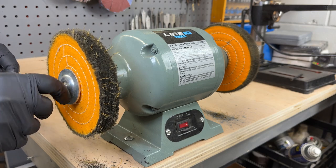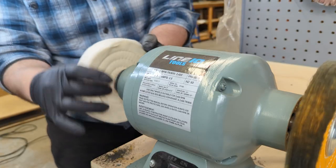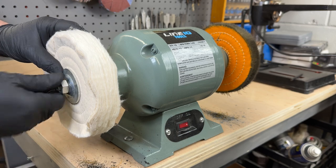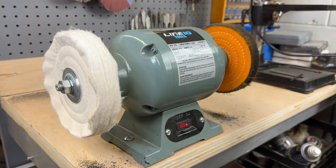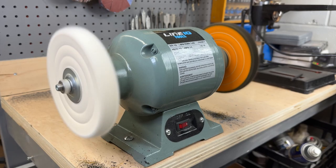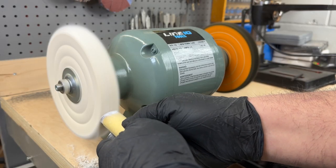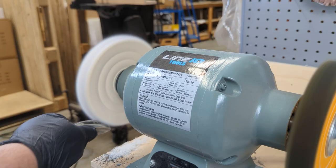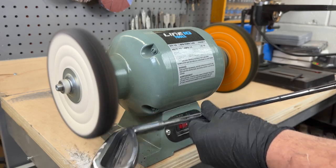In preparation for the third step, I'm going to be changing the wheel — as you can see, it's an easy, straightforward process. This is the final step in the buffing process: the number five white buffing compound in combination with the soft wheel. The number five buffing compound will get the surface super shiny. It's a good idea to reapply the compound frequently as needed — I did that off camera a couple of times. Repeat this step until achieving the desired high-gloss finish.